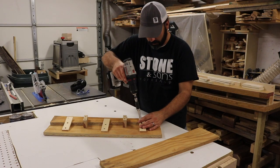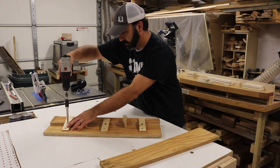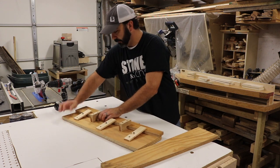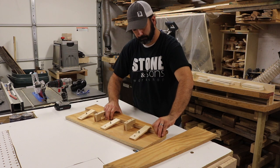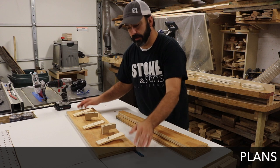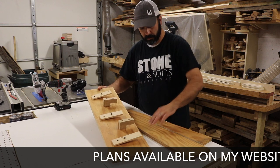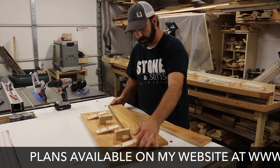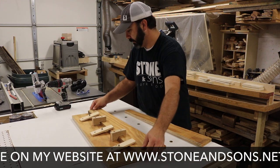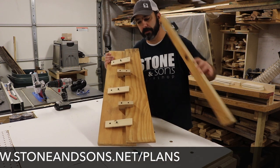All I'm going to do is loosen up these three screws — that's all it should take to get that piece out. And there you go. The reason I really like this is the repeatability: you can use these stop blocks to slide the next piece in, tighten it down, and basically get the exact same size cut you just created.